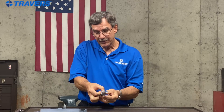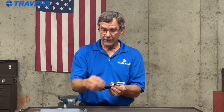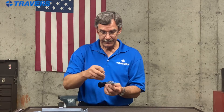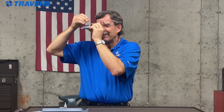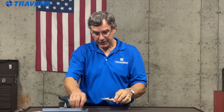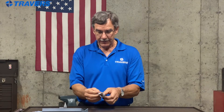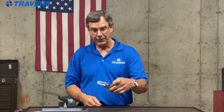I'm on about a five, so I have to calibrate this to get it from five down to zero. I pop the cover off of the little screwdriver head — included in the kit comes a screwdriver — put that right in here. And it's right on the zero now; didn't need to move it very much. What I'm seeing when I look through it is the top section is blue and there's a nice crisp line where below the blue is white. That line has to be right on the zero in order to have it calibrated. So now I'm going to put that rubber protective boot right back on there.